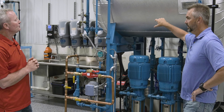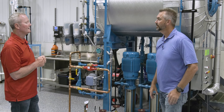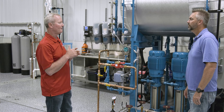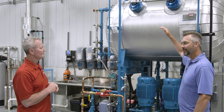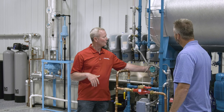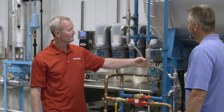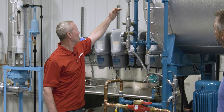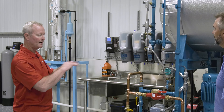So the temperature in the deaerator — what are we talking about? 225 to 227 degrees. Is that typical regardless of the boiler pressure? It really doesn't matter; most boilers are designed for 225 to 227. As for water level in the tank, we've got a differential pressure transmitter checking pressure from the bottom and top of the tank. That differential signal goes to a control valve to maintain the water level at about the center of the tank. Once it's programmed and set up, you leave it alone and let it take care of itself.